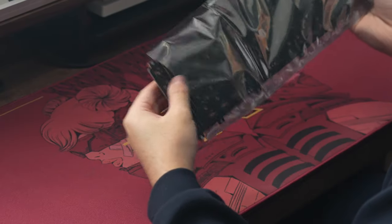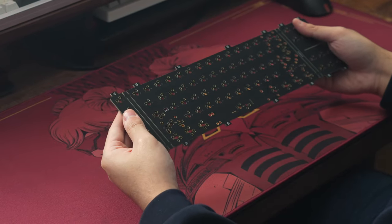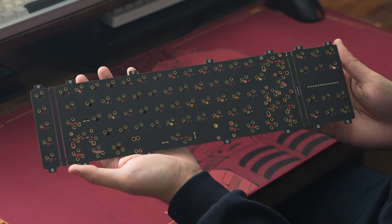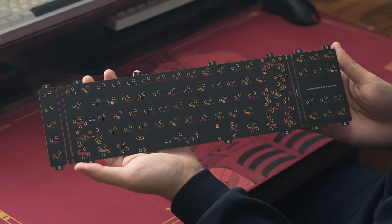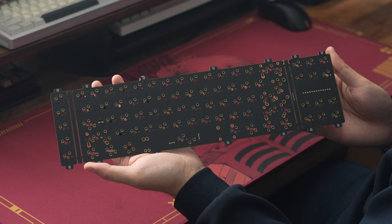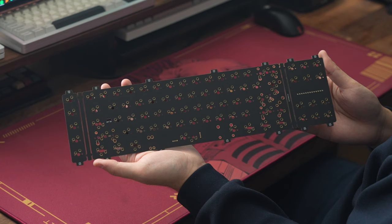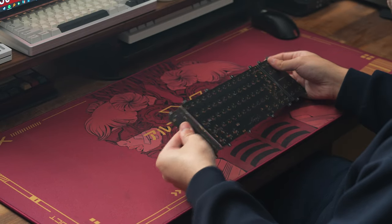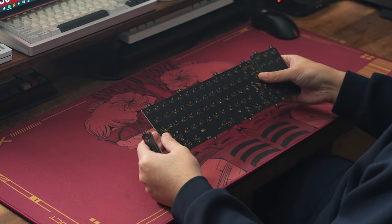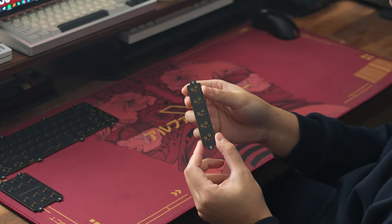Now I'll be building the board out. The PCB is 1.6mm thick without any flex cuts, using Kailh hot swap sockets. There's no RGB lighting except for the LEDs for the LED strip. The PCB has support for multiple layouts and different split keys, so you could build this board with an ISO enter, stepped or regular caps lock, split left or right shift, split backspace, or a 6.25U or 7U spacebar bottom row. The PCBs come pre-attached to each other with breakaway tabs, so you'll need to manually break them off yourself. Then when putting the board together, you'll need to connect all the PCBs together using the provided ribbon cables.